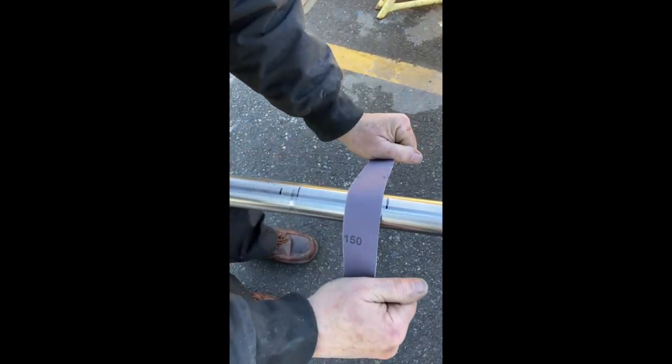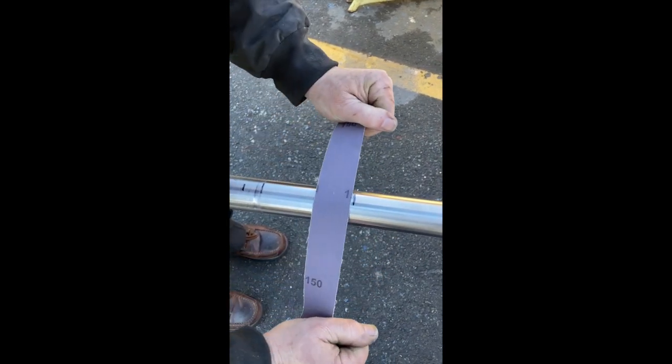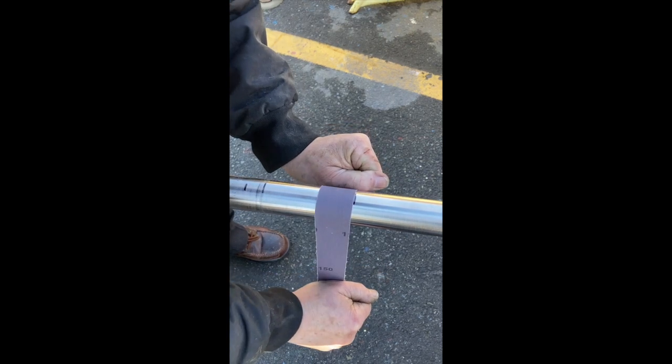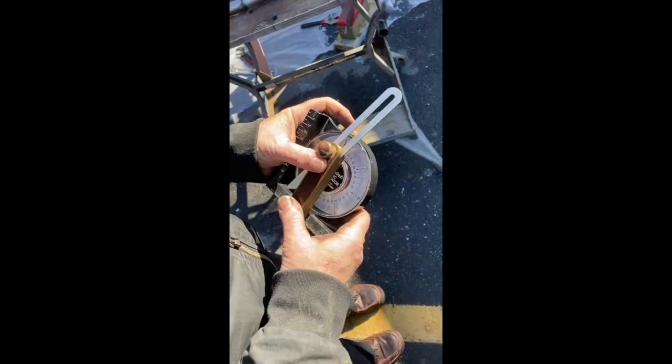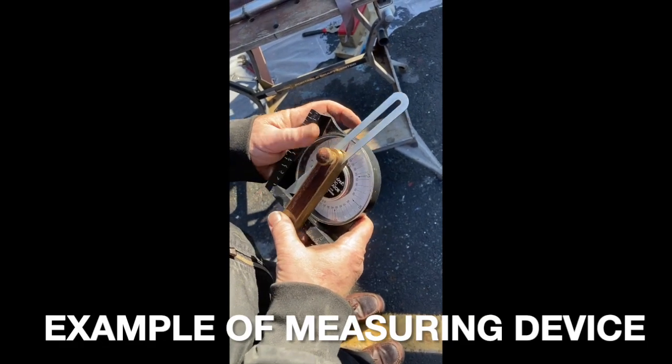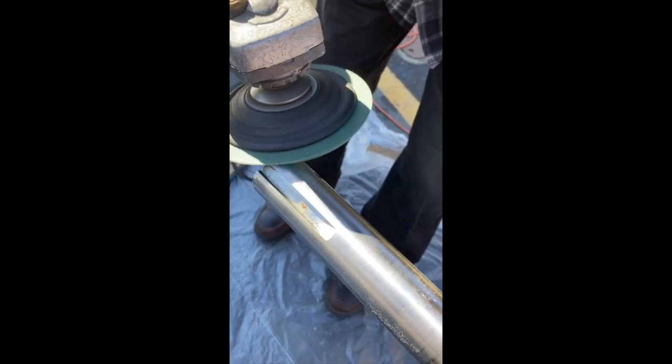In this case we've got it marked. That's all it takes — just to kind of dress it up and provide a proper surface for the seals to break in and cut in. They need that roughness. You do not want to polish it smooth.